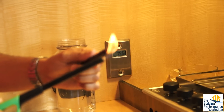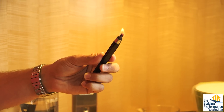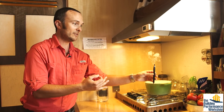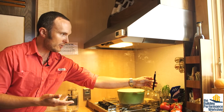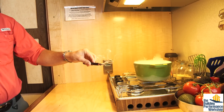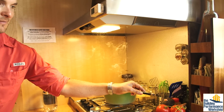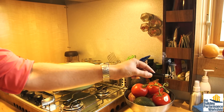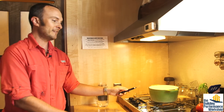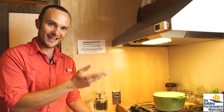So we're going to use an actual hot smoke. This is a $12 smoke pen — I can get it burning and blow it out. You could use a candle for this as well. I can demonstrate that on low, which is where I want to be using it so I can speak over the fan, all of everything happening on top of the stove is going outside. I can come out further and prove it's still going out through the exhaust hood, even though it's not technically on top of the stove. You can demonstrate that this works or does not work with a $12 test. Wouldn't you like to know whether your big, expensive, chrome-finished, glass-topped exhaust hood actually pulls cooking gases to outside? Now you know how to find out.